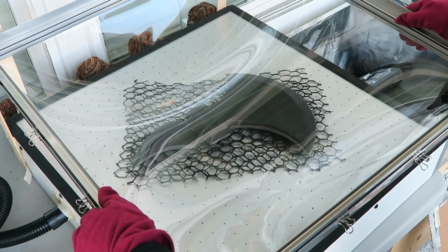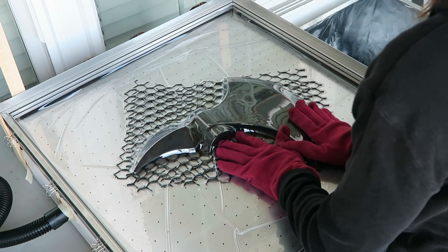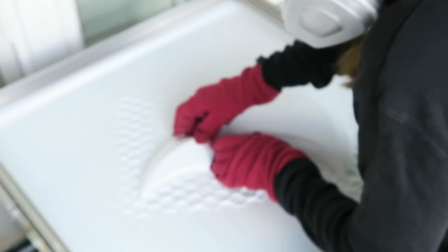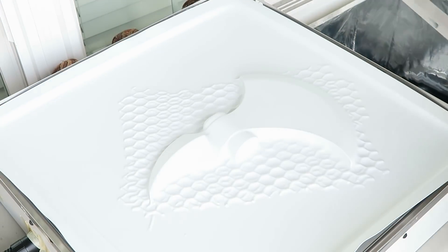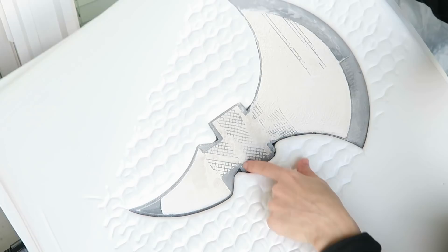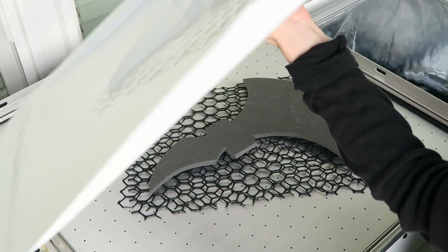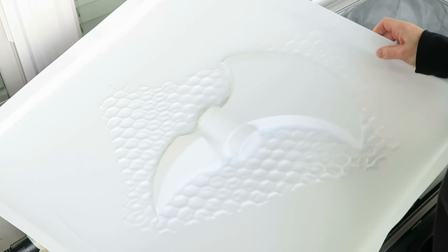I will be finishing this axe one way or another. I'm going to ponder on this a bit and decide what I want to do. I think the result can be improved with further experimentation. I did also try a sheet of 0.02 inch thick PETG, which I left on the heater a bit too long, but it still didn't get very good detail. Putting some mesh underneath to further clear the holes did seem to help with another styrene test — that pull came out with as much detail as the previous one where I used the heat gun, but it's cleaner around the edges. I'm also experimenting with adjusting the heaters and the cover for the heat box to try to get more even heat, and trying to move more quickly when placing the sheet on the forming box. So the latest result is encouraging that it may be possible to make these molds work. If you've got suggestions for improved vacuum forming techniques, please shoot me a comment. Thanks for watching and I'll see you soon.